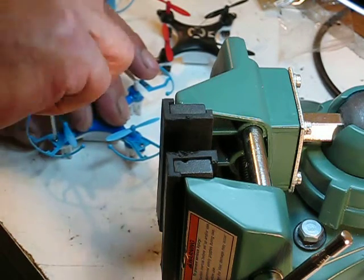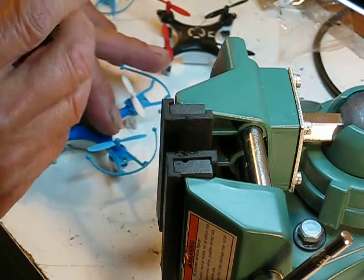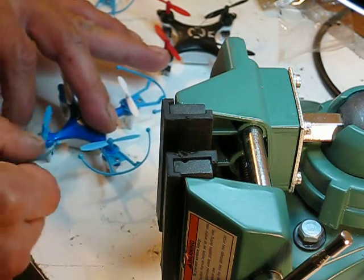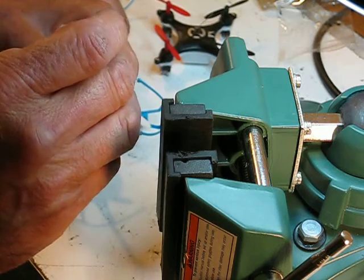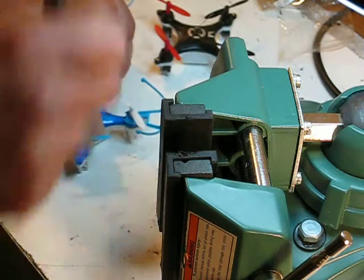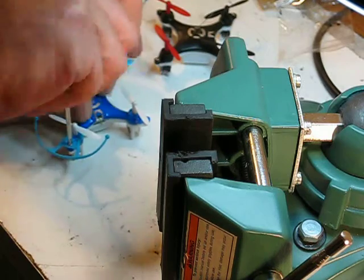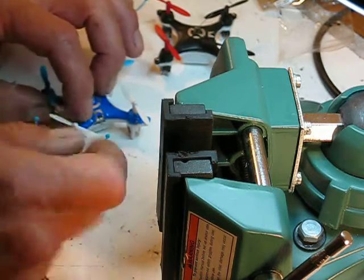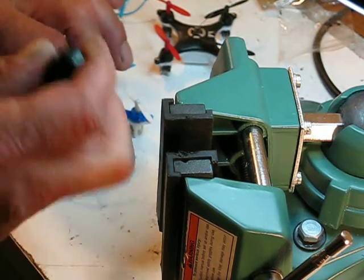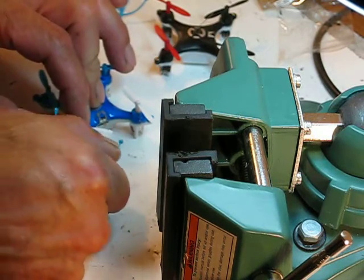And my CX10s have good range, the green and red boards, but sometimes around obstacles they tend to lose a little signal and cut out for a second. Around power lines too, sometimes they'll even drop out completely, just depending if they get behind a tree or something. But I'm thinking if we put an external antenna on top of the CX10s too, one of these little wire ones like I did on the 851, it'll probably eliminate all of that.